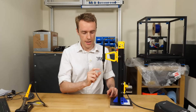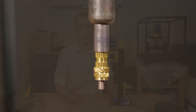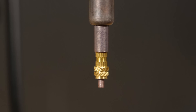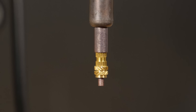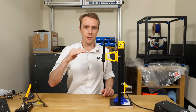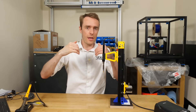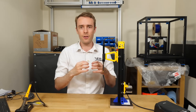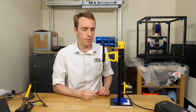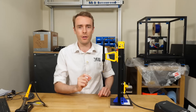The second thing it does is it has a slightly different tip. So instead of using a typical standard soldering iron tip which has a taper, this is a uniquely designed soldering tip — not for soldering at all. It's specifically machined to have a flat face at the end, so you can push vertically downwards without applying any sideward force and not getting latched onto the threaded insert. Those two things make this rig absolutely perfect for putting in threaded inserts.